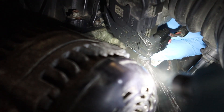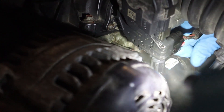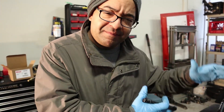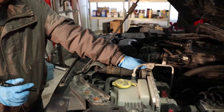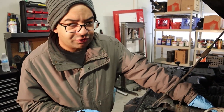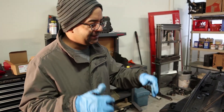Let's let it bleed out a little bit. All right friends, there you have it — we've got everything running as it should. The electric fans are working, the thermostat is open because we know the coolant is circulating, we've got this hose really hot, and we've got nice warm air inside the car. That's it!